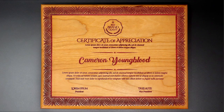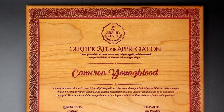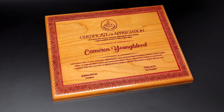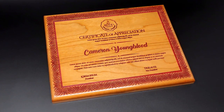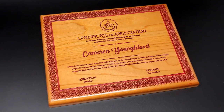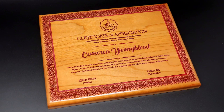The final product is a seamless, beautiful paint fill that is rich in detail and perceived value. This process also works well on oblong or oddly shaped products that can be difficult to effectively mask using paper masking. Although liquid masking will not work on rough or raw woods, it can still be applied in a wide variety of applications. It favors materials that are smooth or coated with a clear polish, including polished stone, glass, plastics, or lacquered wood, as we've shown here.